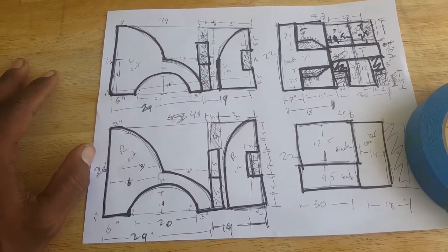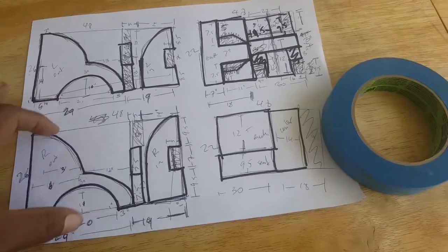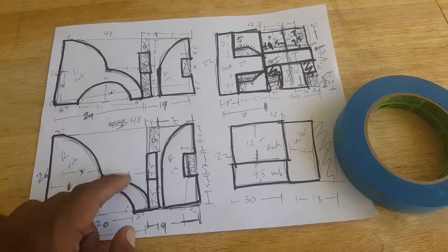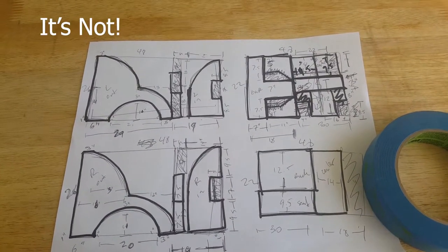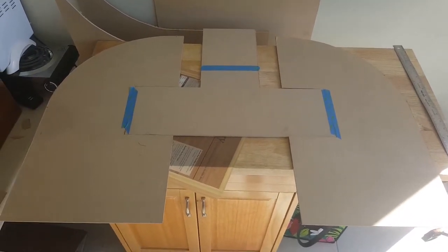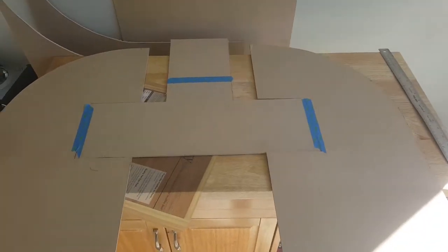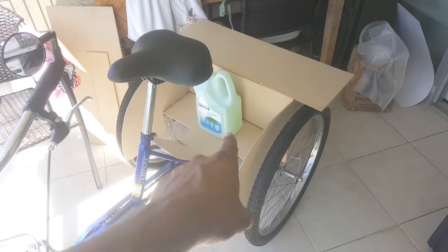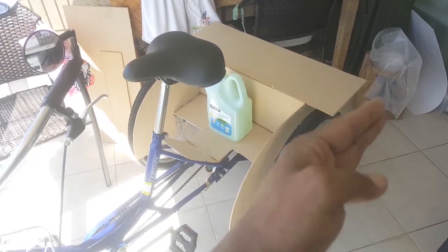Taking the SketchUp design I hand-drew this with measurements: the 26-by-48 boards and the 22-by-48 boards — that's how I'm going to cut them up. I have most of the pieces except the ones that go over the wheel. This is the first setup — the sidewalls and the middle. These are going to stand up; I just taped them to hold them in place while I measure. That's where they'll put their feet, and that's where they'll sit.